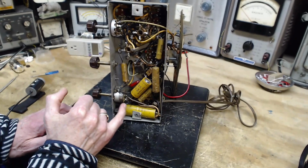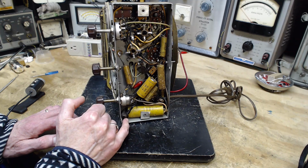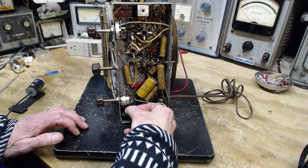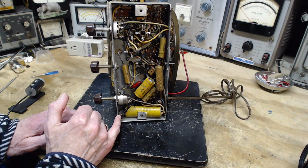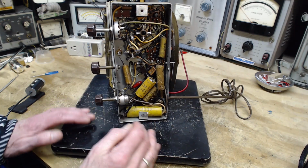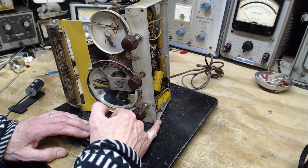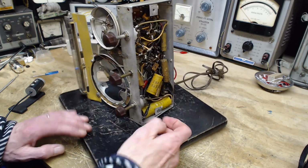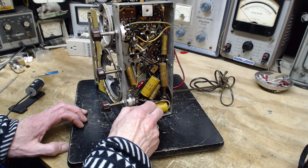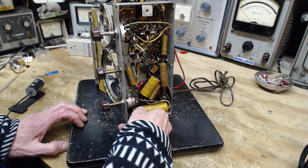So coming right off the on-off switch, one side of the on-off switch, the wire going down to 2 paralleled resistors, fairly large wattage resistors sitting here, kind of floating. This isn't normal. Components like that, they go between supports, they go between terminals. They aren't normally floating out there like this. And also, now I think this is probably not got a metal bottom. I don't have a metal bottom for it, but if it does have a metal bottom, then you got a short circuit situation set up here. You got electrical tape, which has done the job. Generally, electrical tape doesn't last forever.